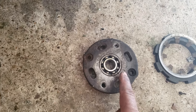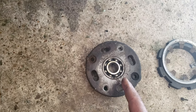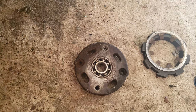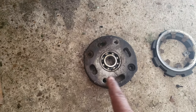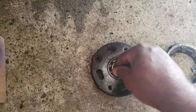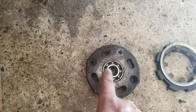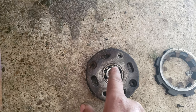You take some wheel bearing grease — you can use number one, two, or three. In my case I'm using a double-zero grease, which I also use on my snapper transmission box. When you take the seal off, you pour the grease in there, and when you spin this bearing around it's going to suck the grease in and lubricate the bearings, extending the life of the bearing without having to bring it into the shop or press in a new bearing.